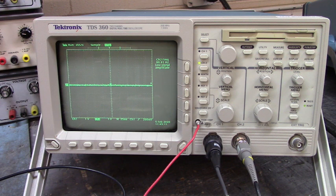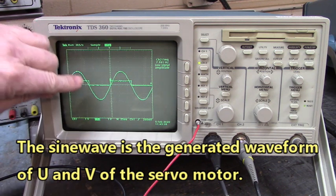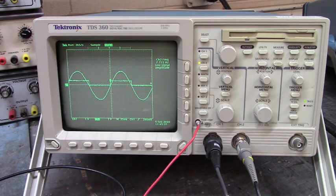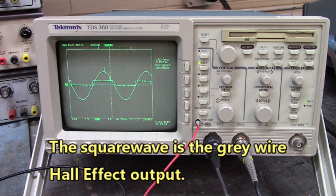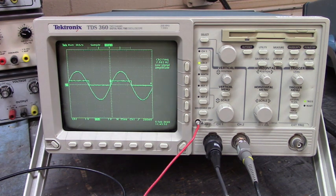Now we're going to look at the generated sine wave of U and V, and we're going to go to the gray wire. Here we're in time again — this is the generated sine wave of U and V, and here we're looking at the gray wire. We're timed on the positive side of the sine wave. So you have three different ways that you could make sure that that shaft is properly timed to that feedback device.